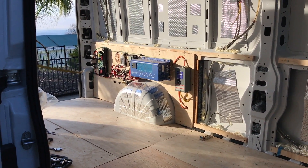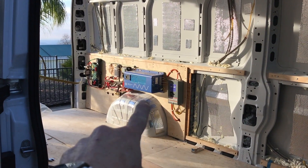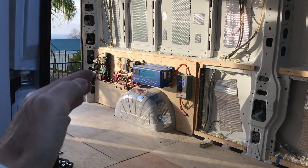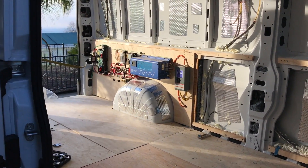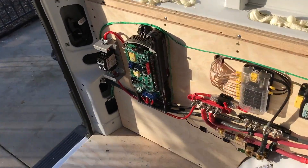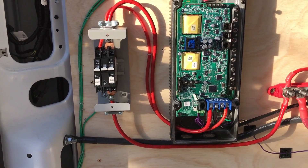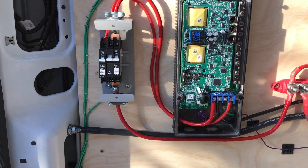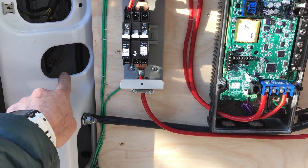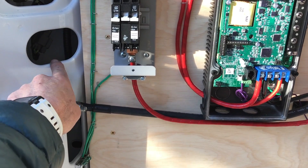I got the solar and the main part of the wiring done. This part over here is basically the AC — you've got the inverter and a breaker panel. From here to the left is basically the DC. I'll go through each one of those things and talk about it. The best way I can do this is to trace the hot wires and show you how those run, so just look at the red wires. There'll be a hot solar wire coming in here from the panels up on the roof.